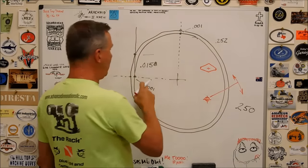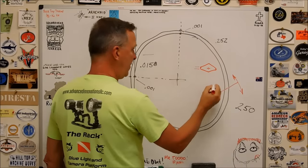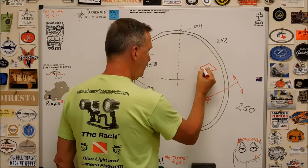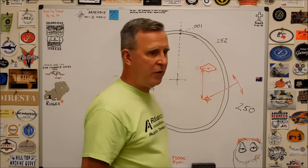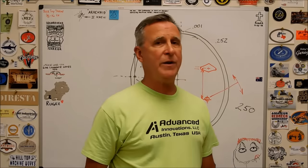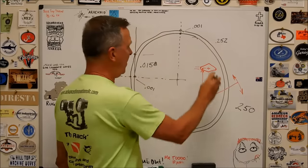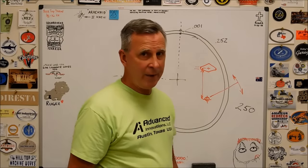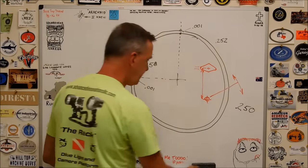Perfect. Now, knowing what you've seen here, the smaller you make that diamond, the more leeway you're going to have center to center. So if you have an old rattle-bolt machine that can't hold its own no matter what day of the week it is, and you try to make a precision fixture, there's your answer, the diamond. And the diamond works because of what you just saw right there.